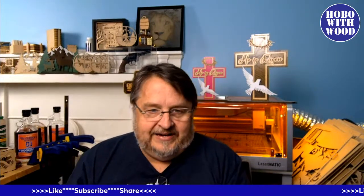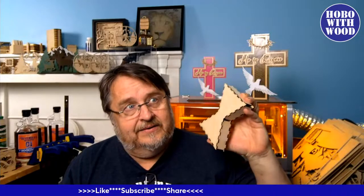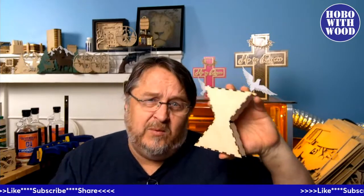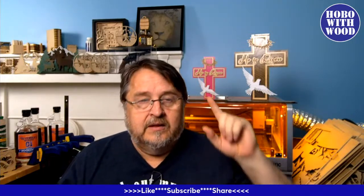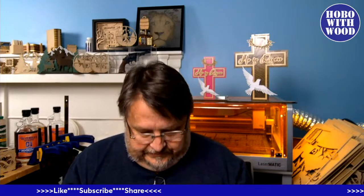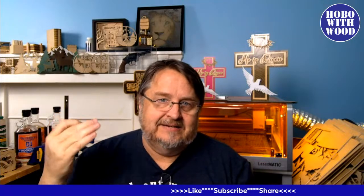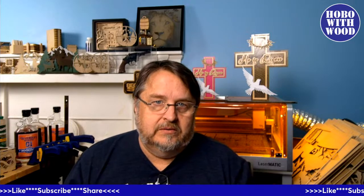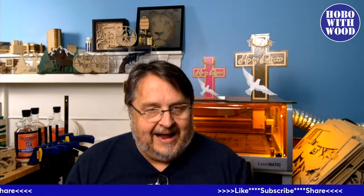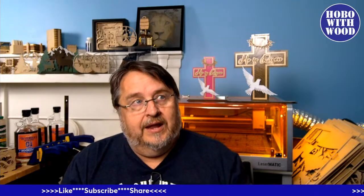All right, guys, so I think that's all that we've got. And like I said, I'm going to continue to learn more and see how wrong I am, how right I was, how partially right I was. But I encourage you to do this. Find out what your spot size is on your laser. Find out its dimensions. Find out which axis has the widest laser, and use that as your scan angle, scan on the X or scan on the Y, whichever one's the widest. When you're doing bamboo, pre-focus it 5 millimeters and then do a test.